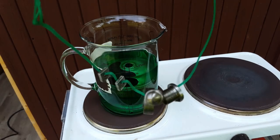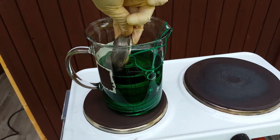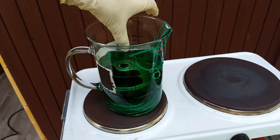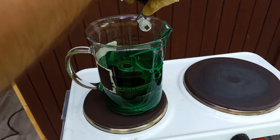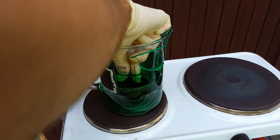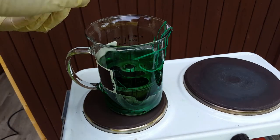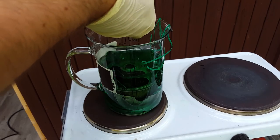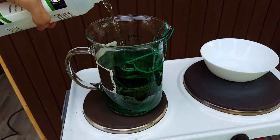You can see that I chose to hold up smaller parts with a plastic-covered wire. The reason for this is that any metal, especially iron or steel, would attract the nickel once the reaction starts. This is also the reason why I am using a glass container. An enamel pot would have also been fine, but the glass lets me watch the process. I should also mention that I tested this glass cup by boiling water in it first, to make sure it would withstand this procedure and not split or burst from the heat of the stove.